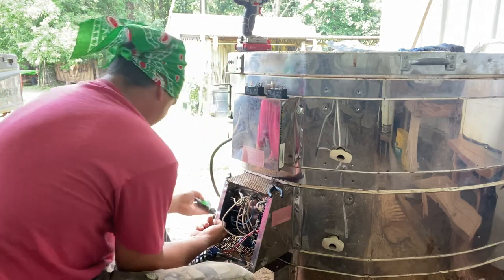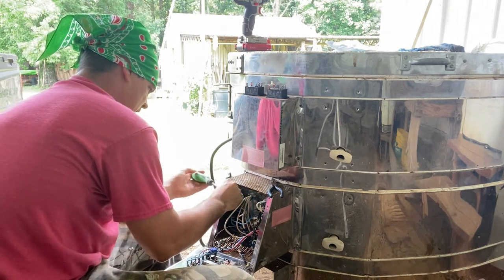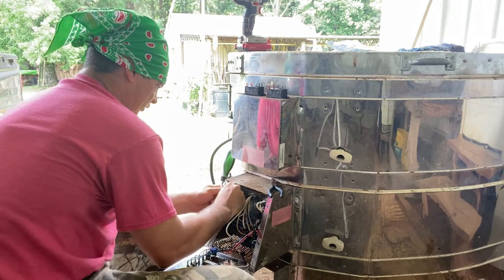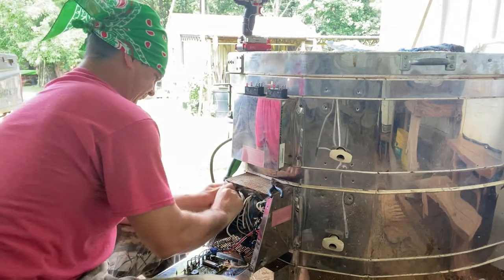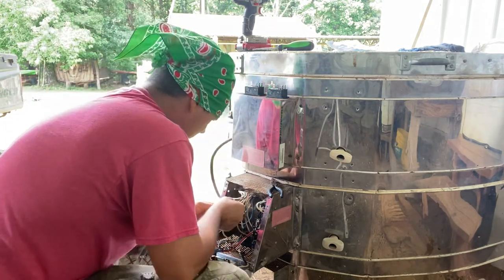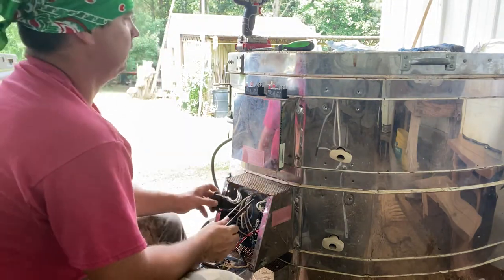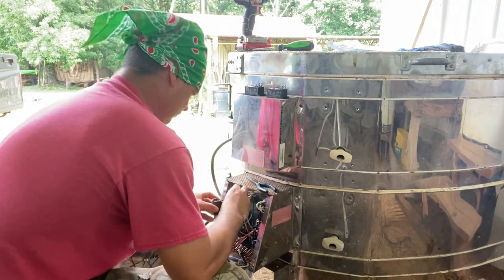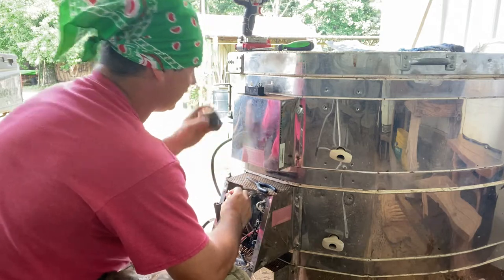Take your finger and hold the back side. I'm gonna loosen all of them before I take any of them completely off. Once they're loose, I can take this top one and pull it loose. What I normally do when I'm swapping relays out is, as I pull these loose, I like to go ahead and plug them onto the other relay so that I know I've got them all back where they go — see, that slipped on there real easy.